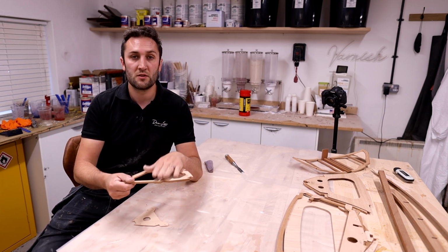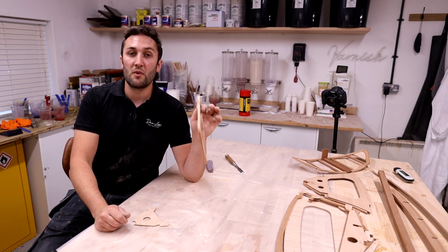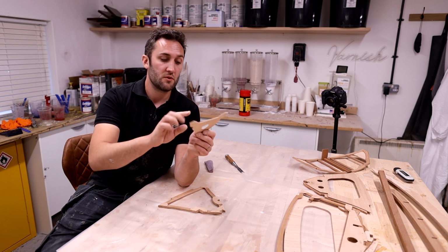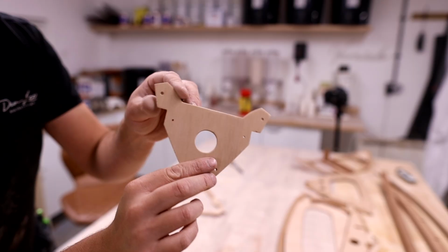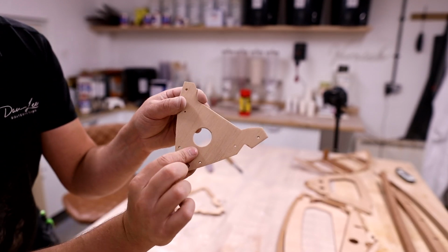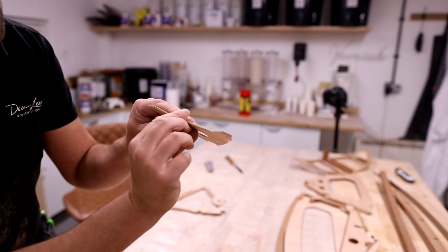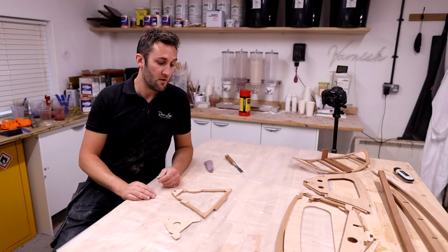So we'll do each face of the frames, and certainly focus on any areas that we may not be able to get good access to once the boat is together. We've also got the bulkhead, so there's edges to consider where you're going to see things. So like this clearance hole through here, we just want a nice rounded inside edge to that so that we can get a good epoxy coverage around there without breaking through the corner. Same with the top side of the bulkhead as well. So that's roughly where we want to be with our first frame.